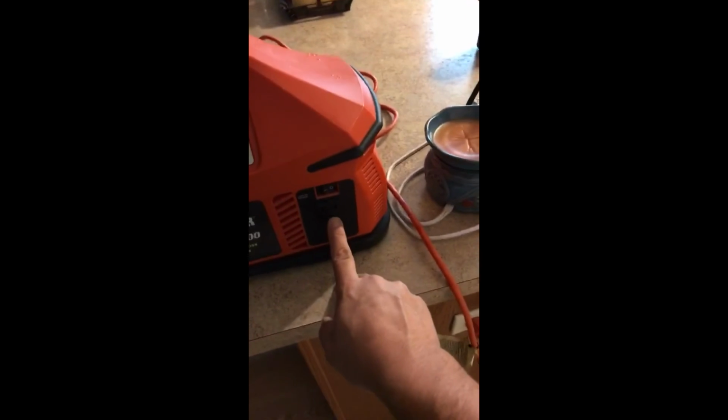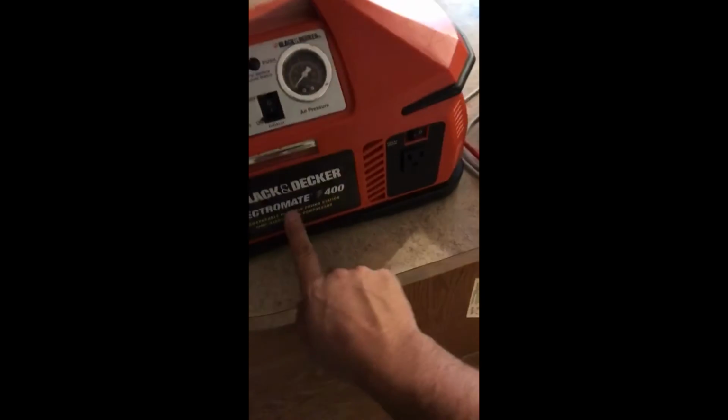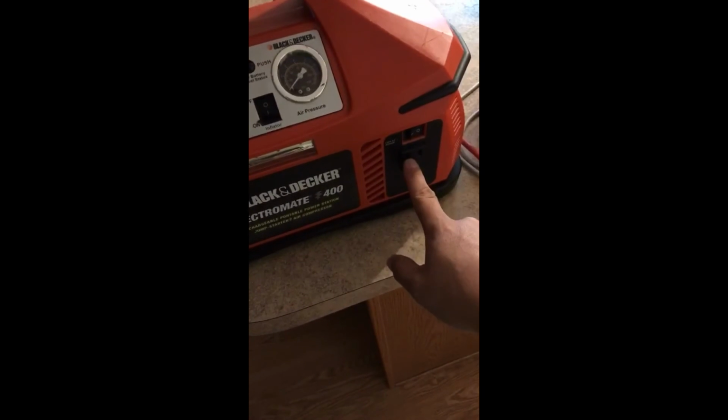One of the things that you may want to think about, if you do want to have internet so you're not bored out of your mind, is to just plug this guy, which right now is running on the generator, and have it running off this. However, when you're converting 12 volts to 120, you lose some energy to heat. Whenever you have stuff normally running in your house, you've got 120 out because Edison killed Tesla, and it gets converted to 12 volts inside here. When I have that plugged in here, we're converting a 12 volt battery to 120 volts, so we lose a lot of energy because of heat. Then you're converting that 120 back into 12, so you lose even more heat.